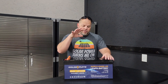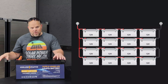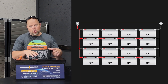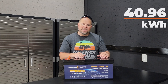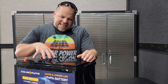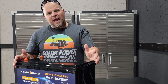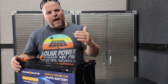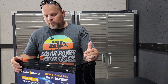The answer to that question is you could put 16 of these together — put four of them in series and then parallel those series together for a total of 16 batteries, giving you a total of 40.96 kilowatt hours. What's so compelling about that is you get 16 batteries at $500 a piece — you're building a 40.96 kilowatt hour battery bank for $8,000. I don't know if I could do that anywhere else.